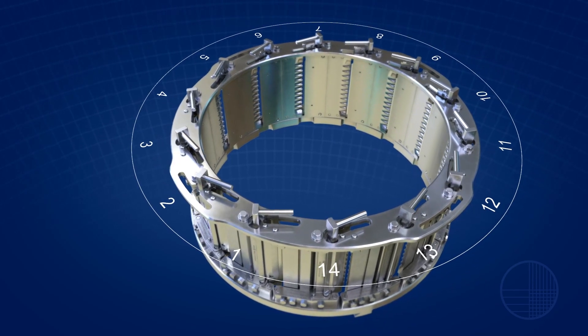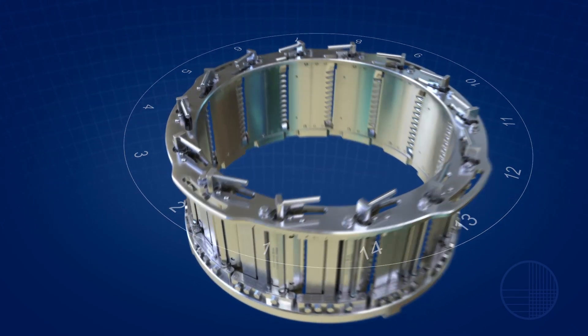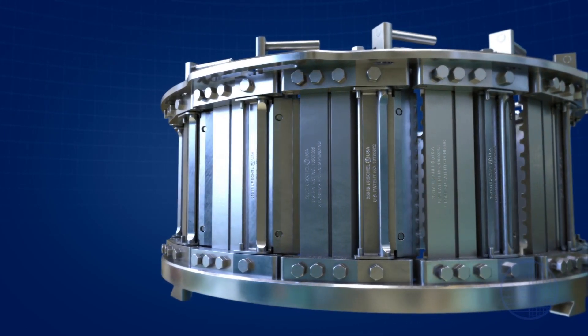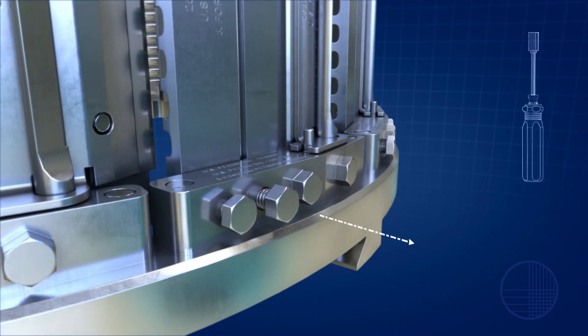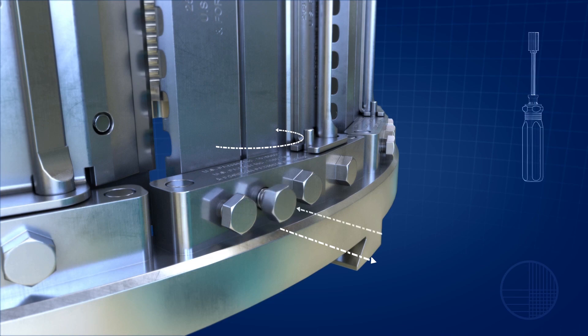14 identical, ideally spaced cutting stations maximize slice engagement to amplify productivity. The modular block design does not incorporate shims or shoes. The SL14 head features a stationary knife position in which the knife holder and the knife edge remain fixed during microadjustments and throughout your production runs.